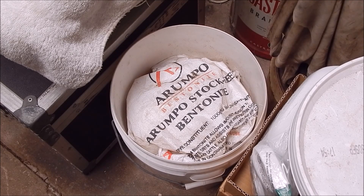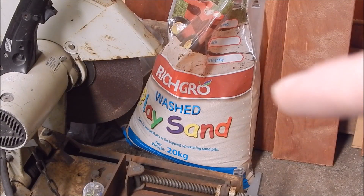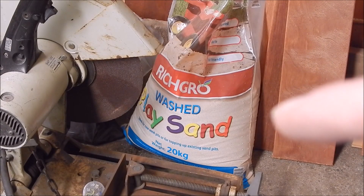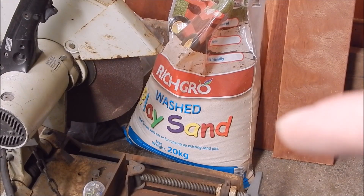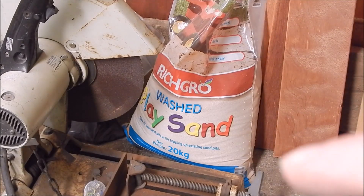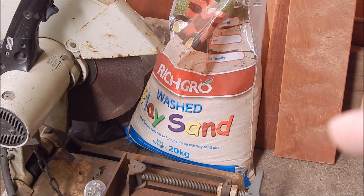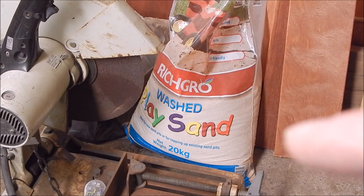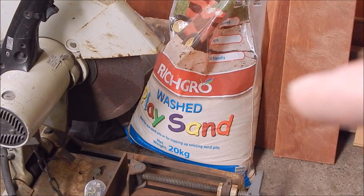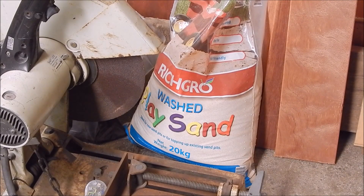So I've been in a bit of a quandary. Over here I've also got kids' play pit sand — very fine washed sand. I can mix it in with the bentonite, I can mix it with the mortar mix, I can mix it with refractory cement. I've got all these options and I'm not sure which way to go. I want it to be durable and I know that perlite will crumble — it definitely packs up. I'll show you the old furnace I've got.